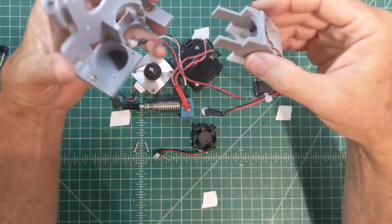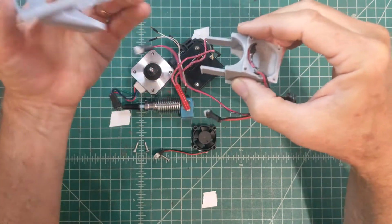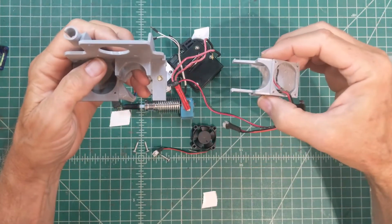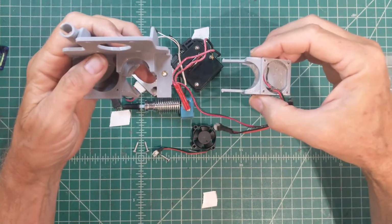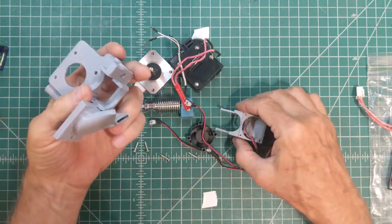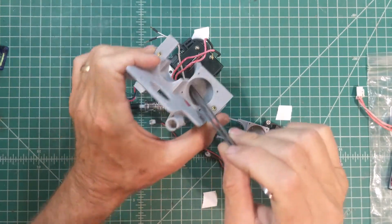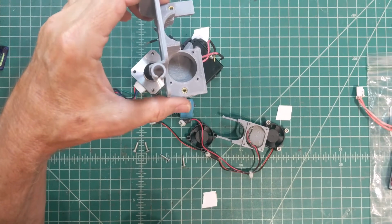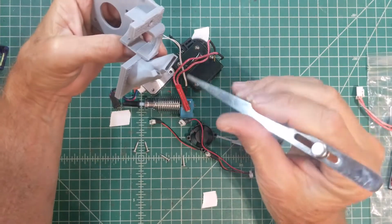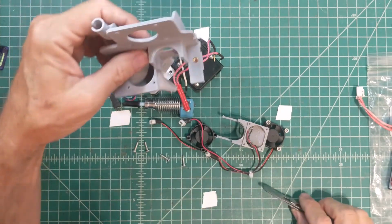This is available on Thingiverse. I'll put a link in the description below. It is a 2-part deal here. You do want to print it upright, like it's used and like it's presented in Thingiverse, which will require some support settings to be on. That all comes off pretty easily. In order to not get too much support material down in the nozzle area, I found out that in Cura I could set the overhang angle as high as 60 degrees, and that resulted in only a little bit of support material that could be pried out from the outside with an X-Acto knife.